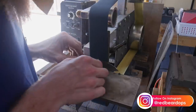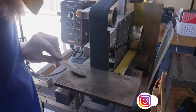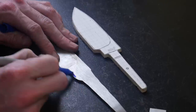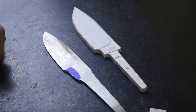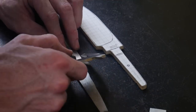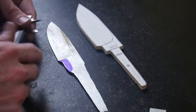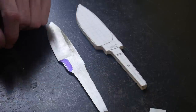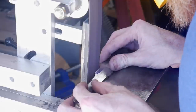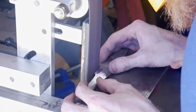Just to get everything kind of close — not even really close to the final dimensions, but maybe 70% of the way there before heat treating. I think the edge of this blade is around 40 thousandths of an inch, maybe 45 thousandths, so it's pretty thick. Now that the spine at the top of the ricasso and both flats of the ricasso are squared to each other, they will be reference points moving further into this build.